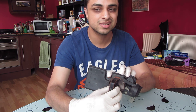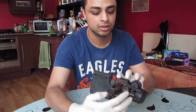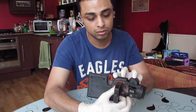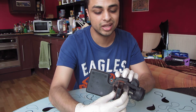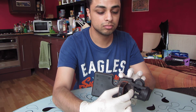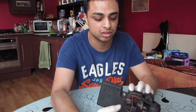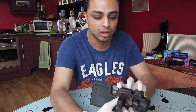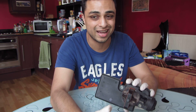It went to about 45 degrees and then gradually eased up — so it's not bad, but it's not great. Again: flap closed, finger on the little hole, then release the flap. It kind of went to 45 degrees and then gradually eased off. Obviously the worst case scenario for the vacuum would be that you cover it and it immediately springs back — that means the vacuum is not holding any suction at all. The best case scenario would be that you close the flap, put the finger on the hole, and it stays exactly where it is. If that's the case then your DISA vacuum pump is in excellent condition.